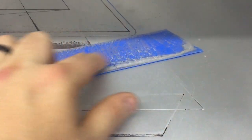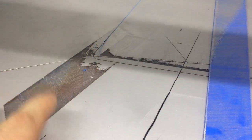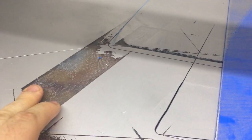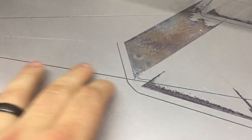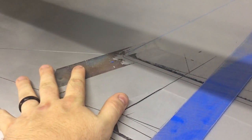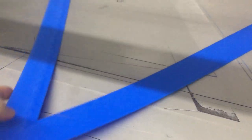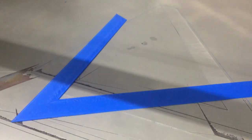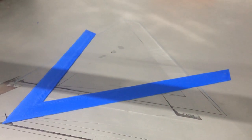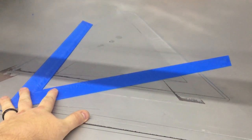And so this coating's not as tough as I would like. So I'm gonna have to do something about this. One, I'm gonna dial in how the hot end sits on the bed. So I'm gonna get my bed height dialed in. There's a lot of bumps and warps and waves in this bed, which means, sadly, the polypropylene may be a good idea on a smaller size printer, but not so great on this hockey rink of a printer. So I'll need another bed solution. So stay tuned for that.